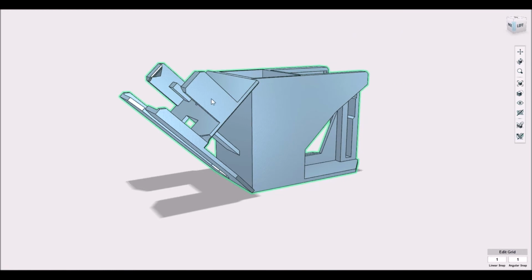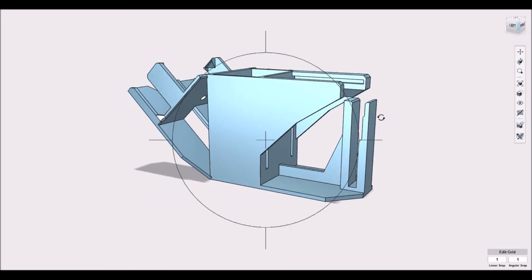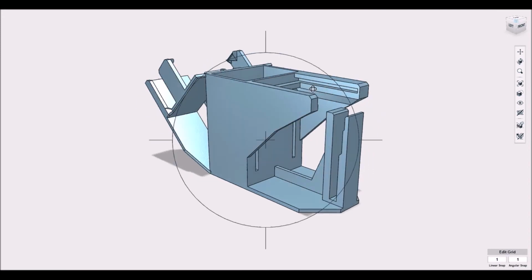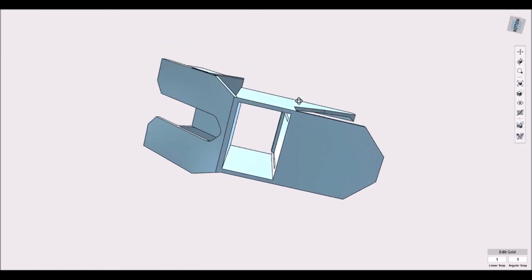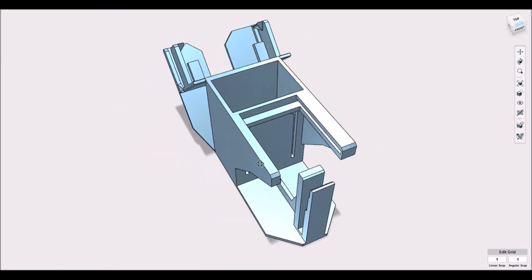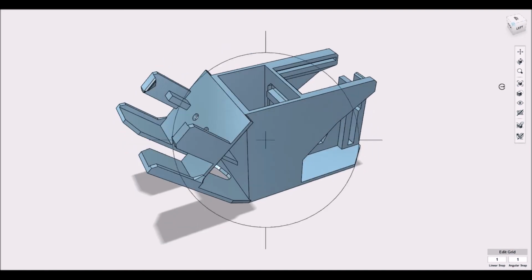This bracket sits above the cat detection sensor bracket on the same shaft coming from the stand. On the left is the angled bracket that holds the people sensor. On the other side, we have a vertical bracket to hold the MCU, and at the top there's a horizontal bracket to hold the liquid crystal display. Behind the MCU there's a bit of a cavity to tuck in any stray wires. This bracket also has a spring-loaded clip, if needed, to position it on the shaft.